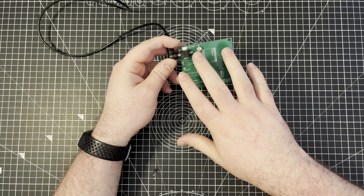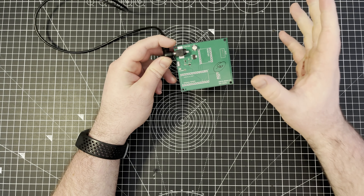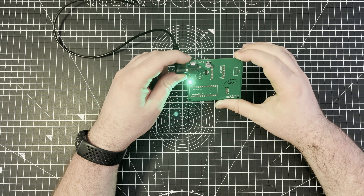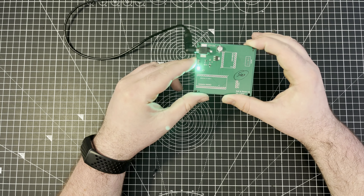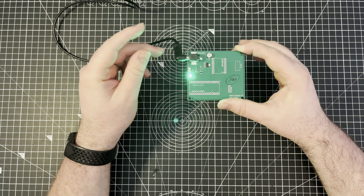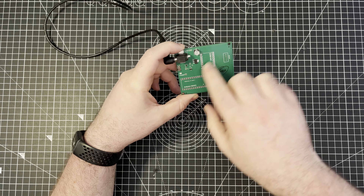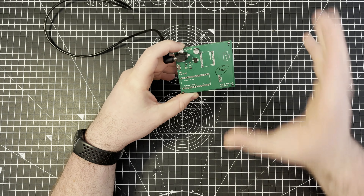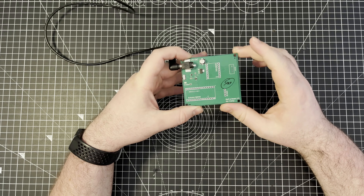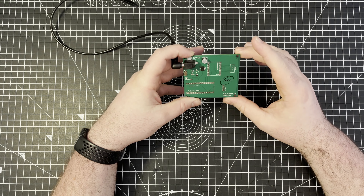But this fresh board that I had, where I properly split the trace on, the resistor hasn't burned out because I hadn't plugged it in yet. It works! The power switch doesn't do anything obviously right now, but the power switch is a good indicator that it is working. I measured voltages all around the board and all the pins are sitting at the right voltages. I'm fairly confident this works now with the whole switching circuit and everything.